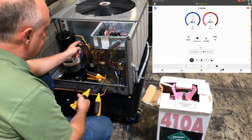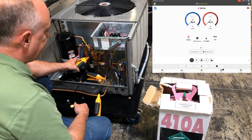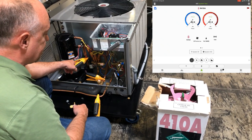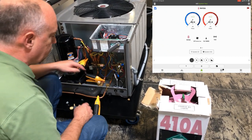For the discharge line, I want to be at least six to eight inches away. If your lines are dirty at all, you have to do a little light sanding to get good connections. So I've got my discharge line, suction line, and liquid line all hooked up.